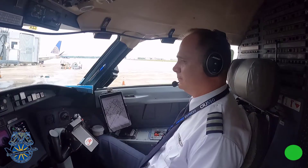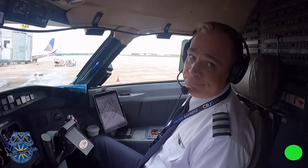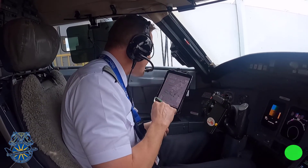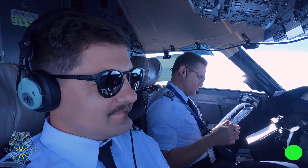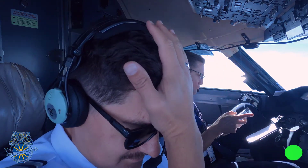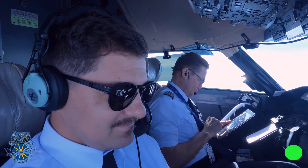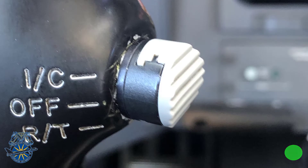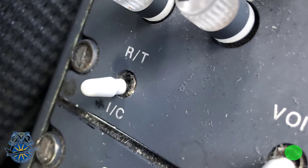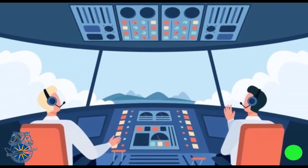There are two versions of hot-miking: gratuitous and subtle. In the end, neither are appreciated. We are no longer in a prop environment — it's actually really quiet. Every nuance can be heard over an open intercom channel. Even during times when nothing's being said, static airflow pickup coming over an open intercom channel can be really annoying. Intercom is not the default position. Off is the default position. Speak freely, but when you're done, turn your intercom off.